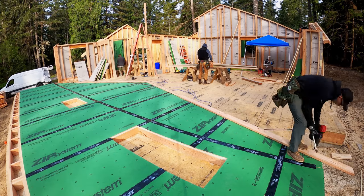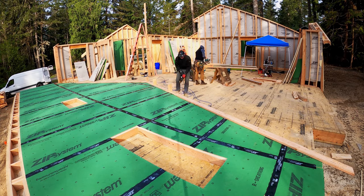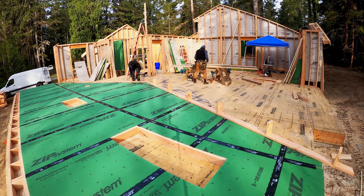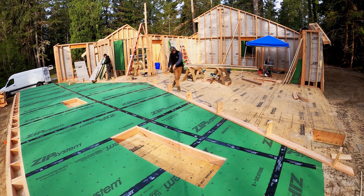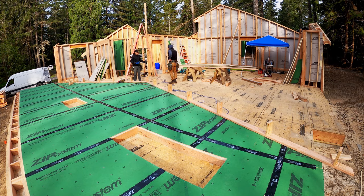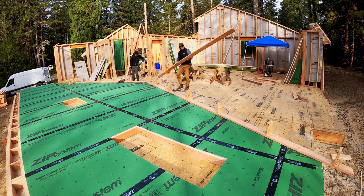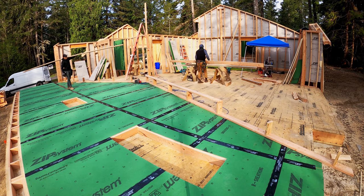Of course, I didn't get the rest of the time lapse. I apologize for that. I thought I got a sheeting. Anyway, so now we're doing the overhang for that wall. For us, we always go with the 2x6 nailed to the wall. Then we go with little cripple studs, haphazardly nailed, doesn't matter, but we shoot for like 4 to 6 foot on center. You're gonna see why in just a minute. It doesn't matter. And then 2x6 top plates.